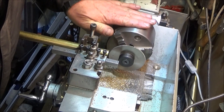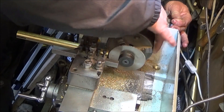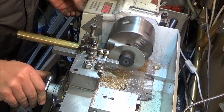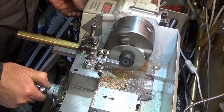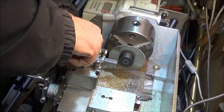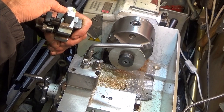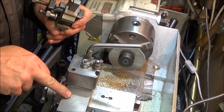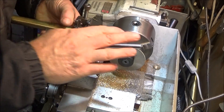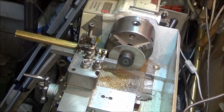So it's all ready to go — just check everything's clear by moving your chuck. Then put it into low gear and start up. Just touch the saw on the end face, then take it off and see whether you're dead center on the center hole. If not, undo the locking screws on the compound and move it in whatever direction you need to get dead center, then touch on with the saw again and try again to confirm you've achieved that.